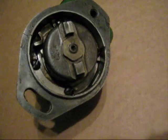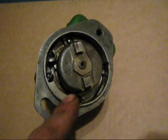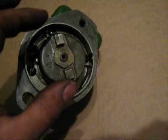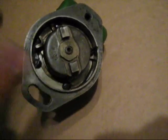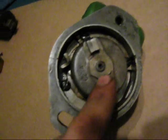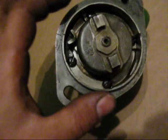I know it's very similar, but I was a little disappointed that the movie only showed a C model. Anyways, you take this nut off, and then this cup assembly here has a spring inside of it. You kind of have to pry it up a little bit with screwdrivers, and it may spring off or it may just disintegrate, because some of them do. There's a spring inside there, and there are two washers that are semi-circle. The semi-circle washers have a little notch cut out, and the center of the spring is held under tension against those washers. The shaft here is actually semi-circle, which allows those washers to attach to it with the tension of the spring.